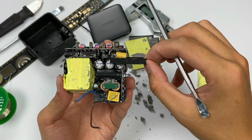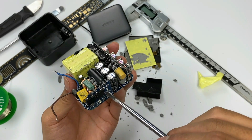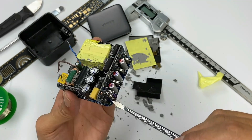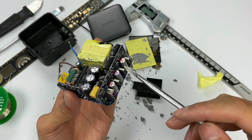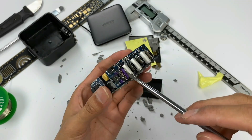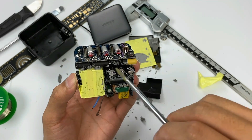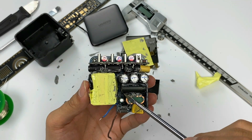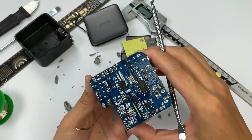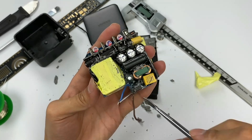This is the isolation plate between the electrolytic capacitor and the small output PCB. It also adopts multiple PCBs. This is the small PCB at the input — it has two electrolytic capacitors and a bridge rectifier. There is also a small PCB at the output with four USB receptacles mounted on it. ChargerLab found this charger adopts the architecture of high-frequency QR flyback topology and secondary step-down circuits. The switching power supply outputs a fixed voltage, and multiple secondary step-down circuits output different voltages. This charger does not have the PFC boost circuit that most high-power chargers have, so it can be smaller.